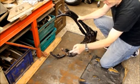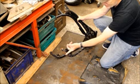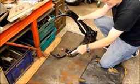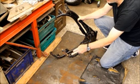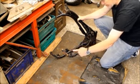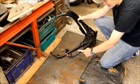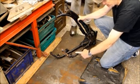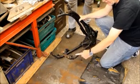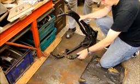Yeah, so if we cut the frame here, that's what it would normally do. But it would mean we've got a problem with this, because this would have to be moved, and it's just a lot of hassle and grief to do that. So rather than doing that, we're going to cut the frame further back here maybe, and then under the brackets. On the bracket. Yeah, maybe about half an inch or something just below. And that way it's a simpler job.